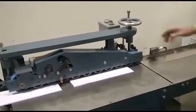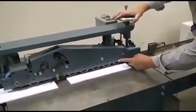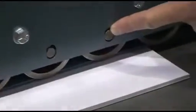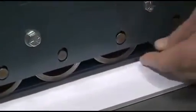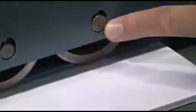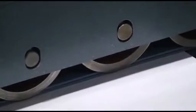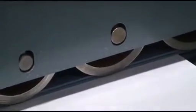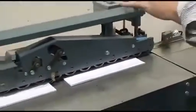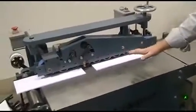Very easy setup for that. These are spring-loaded rollers that are coming down against the product, and this shaft is going through the roller. As soon as it lifts up off of here — if you can get a close-up of that — you can see it's putting tension, just a little, and that is about what you want right there. Then everything is set for the thickness of the work going through the machine.